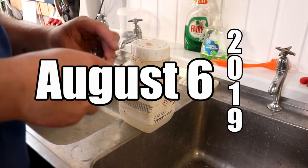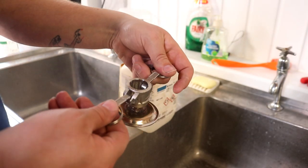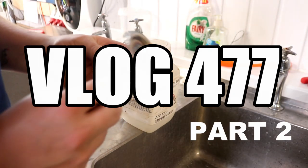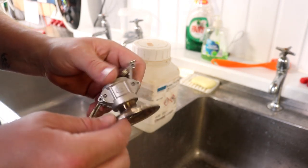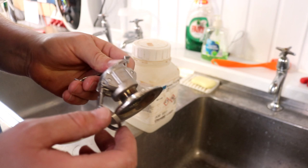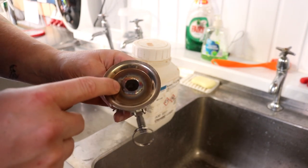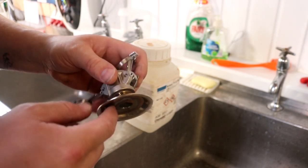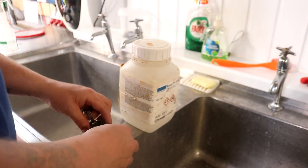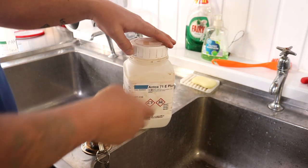Here we are at the sink, and here is one of the finished fittings. You can see all this gold, rainbow, and straw coloring in here — that's an indicator that I had the temperature correct while I was welding. If it was black or really sloppy, that would mean I had the amps too high, so my foot control with the pedal must have been pretty good.